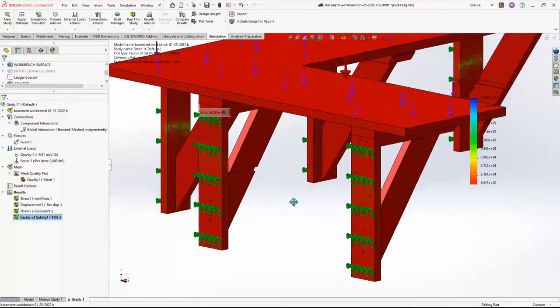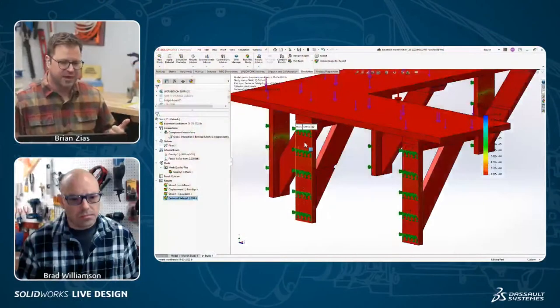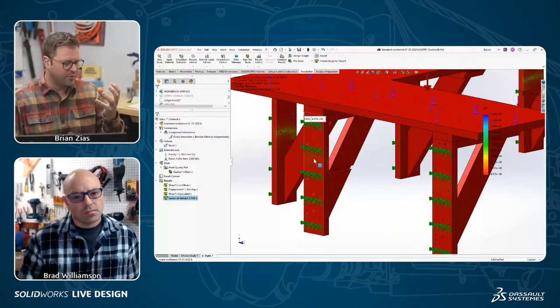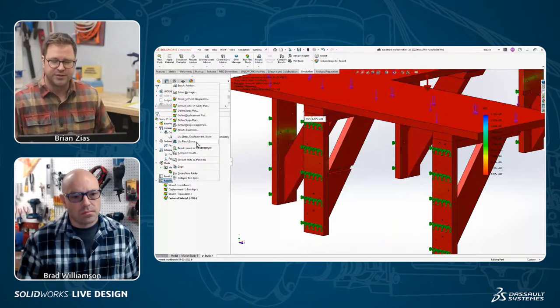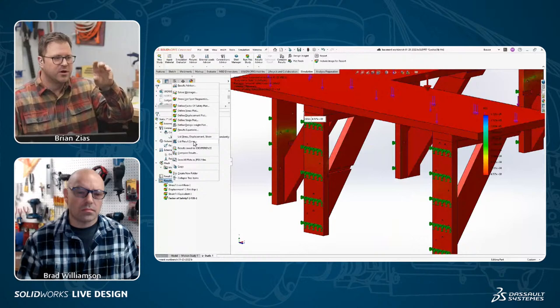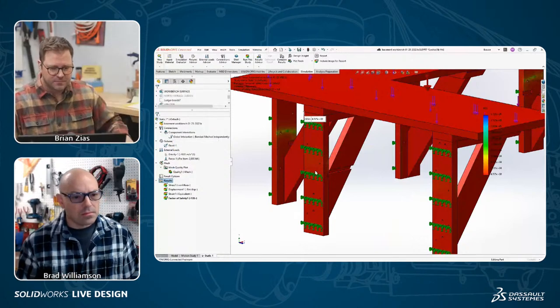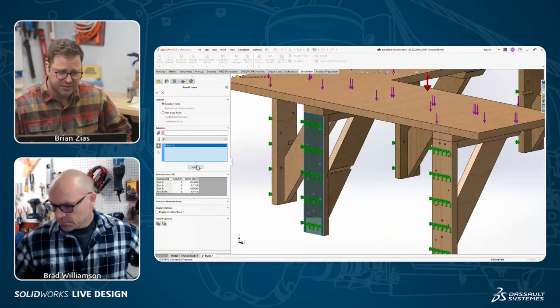We've had a lot of good simulation lab designs, but what you really want to do is create what we call a virtual wall. Now, with the virtual wall, I can then put in virtual fasteners, and what I ended up doing was doing that because then I could get the fastener force. So think of it this way. Anywhere that you have a clamp or you're telling SOLIDWORKS zero deformation, you can pull out resultant forces. So if I would have fixed it or adhered it with a fastener, or if I would use the fastener holes, let's take a look at how much force is flowing through this fixture here.